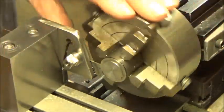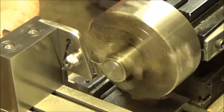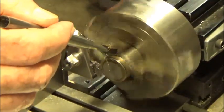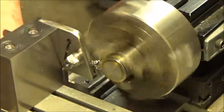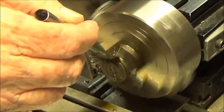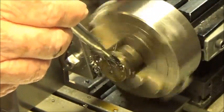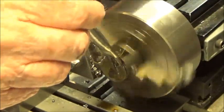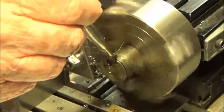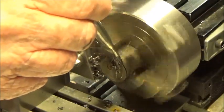I think I've got a little groove there started, so we're good. It's running fairly fast actually, but I'm afraid if I slow it down... it takes a lot of oil. And if you let off on the cut, it'll chatter. But if you keep the cut steady and keep the oil to it, we're making a steady cut through there. It's not going to cut it off as fast as it would on the mini lathe or any larger lathe.